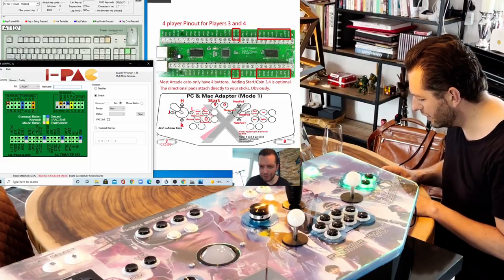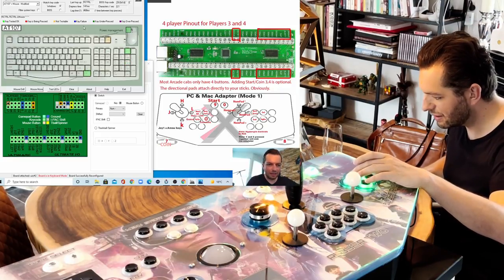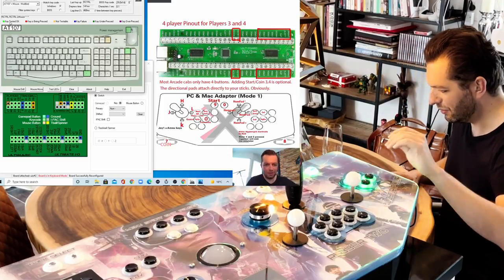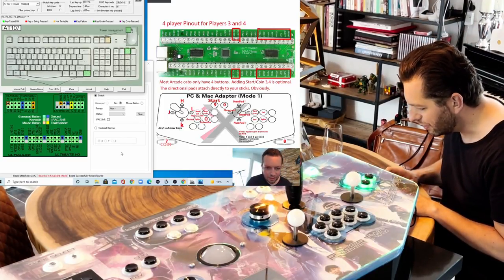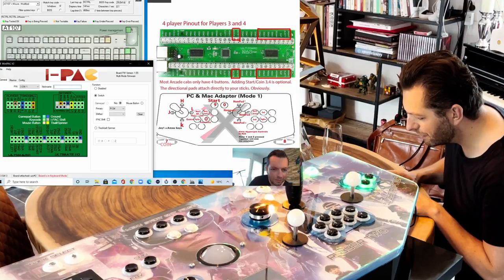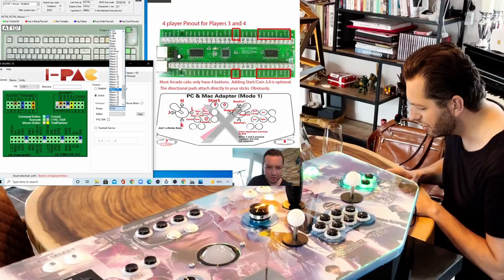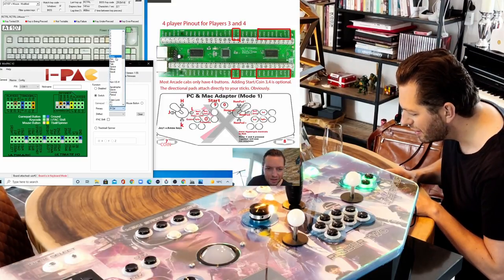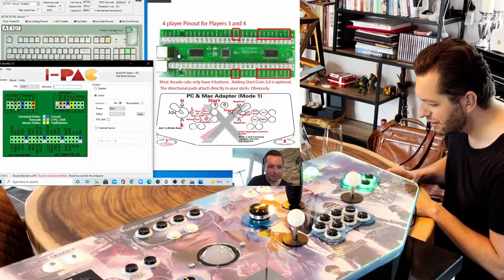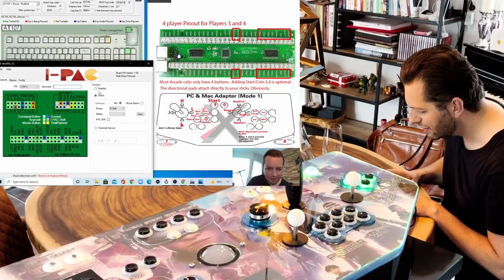Then we go to the 4 buttons we are using. So button number 1, it should be backspace, and in our case, this is right control, which is not okay. So now we need to actually find which of these buttons is mapped as right control, and switch one is mapped as right control. So this one was easy to find, and it should be backspace. So let's set it to backspace. Switch two is delete. So we will make it delete.